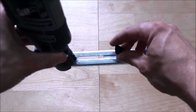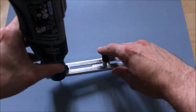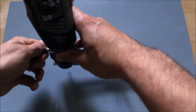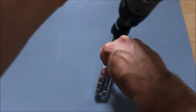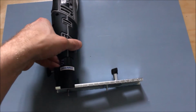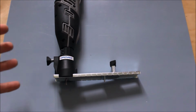Okay, and basically what I do is when I put it on a piece of Perspex, for example, once I get my circle aligned, I basically plonk my circle on there, and then as I'm cutting, if I adjust the feed gauge here, like so, I can just cut all the way around, like so. It's a bit like a compass, but I'm cutting the actual material. This is actually quite a useful tool. Some people don't really like using it, but I've managed to cut my circle with it without any hassle.